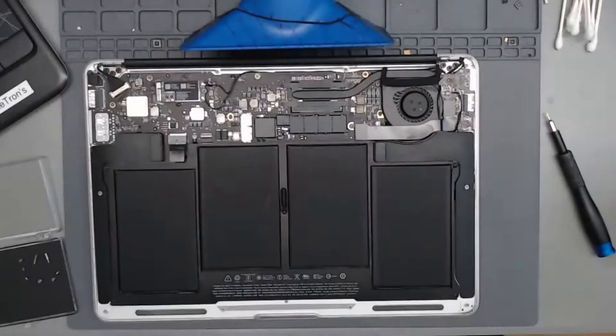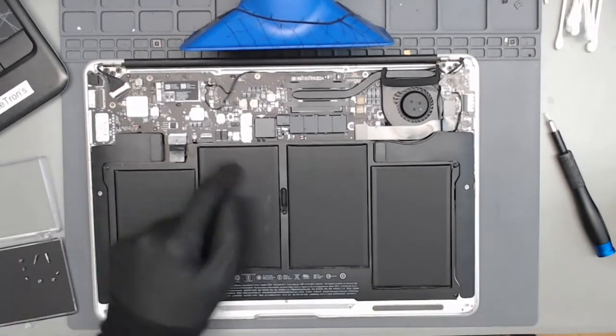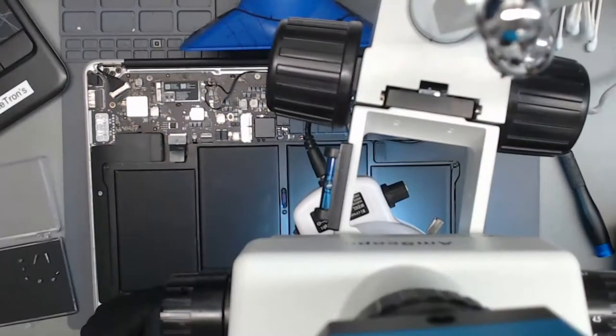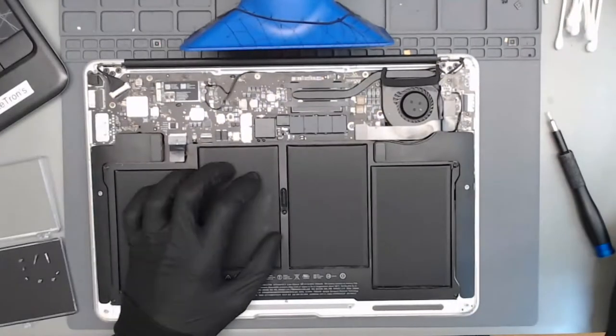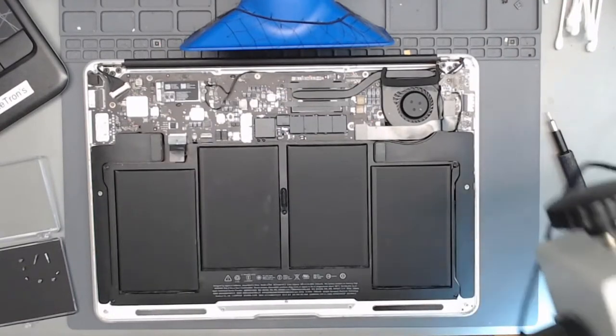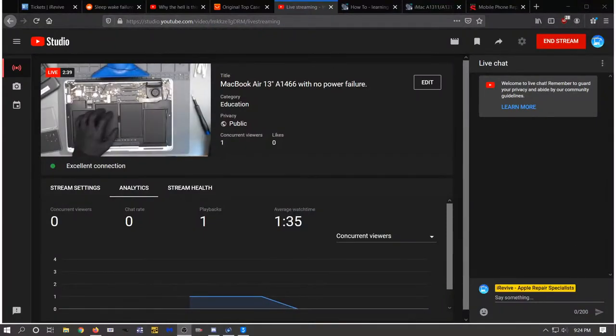And what do we have hiding in here? I see a little bit of liquid damage around our PP3V. This isn't one of the newer models. This is going to be a PP3V42G3H hot power supply. So let's check and see what's going on.